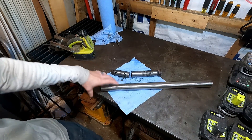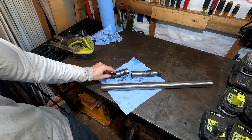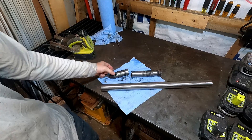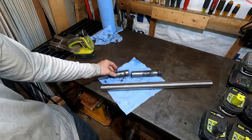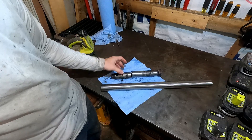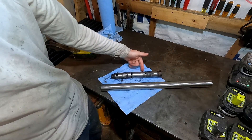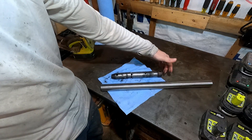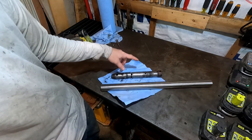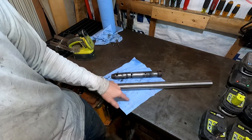The plan is I'm going to cut this to length and grind a lead-in on it. Because it's not really that hard, I might even be able to get the retaining hole drilled in it — I'm going to try. If I can't, I can grind a groove in it and modify how it mounts on the machine. The feature I'm certainly not going to be able to get into it is the grease holes.